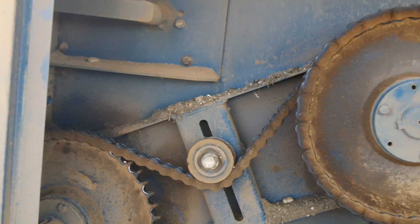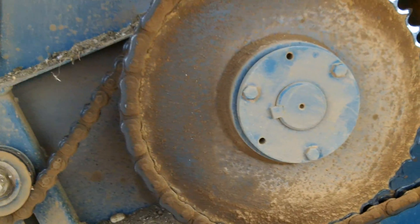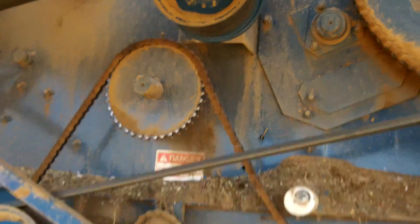Here's another look at the mechanical side of it — all the sprockets and chains that drive the drums that have the teeth on them for the thrasher, all the way up. And here's your blower motor, your fan — your triple fan here — that sends the air to drive the peanuts that are collected right here from the central drum up into the hopper. A lot of moving parts on this machine.